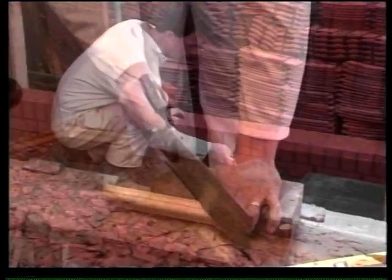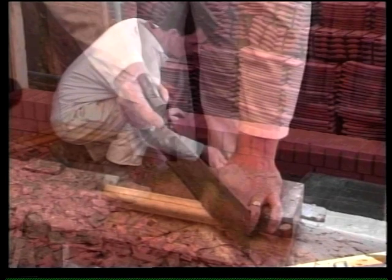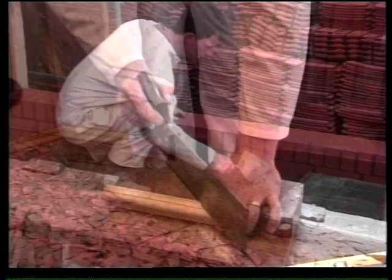Now that you've a starting point, continue to lay the slabs from your first slab. As you lay your other slabs, ensure the edges butt up to each other to maintain squareness. However, it must be pointed out that this is only the case when the slabs being used have a straight edge.